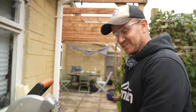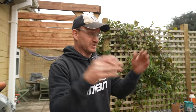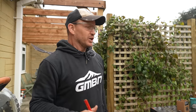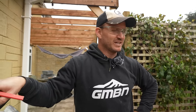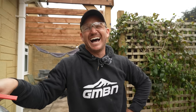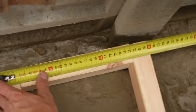We have to actually get this right, because if we don't get this right the numbers on the door are going to be totally weird, and we want even numbers. So the gap: if I go 30, which is 60, take away 60 from the overall length — which gives you 190. Actually it was 180. Half of 180 is 90. All right, let's do the same over there.